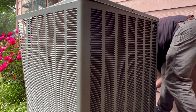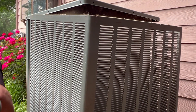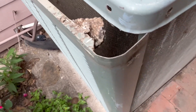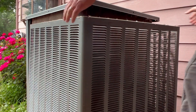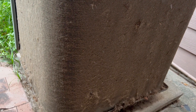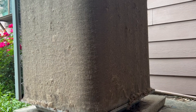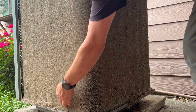However, what I'm going to do is remove the cover and show you how clean or dirty it is beneath this cover. This is an old wasp's nest, so you're going to want to be careful if this is something that you're going to be doing yourself. So we removed the cover, and these coils are not clean. The condenser looked clean when the cover was on, but once you remove that cover, you can see the mat of dirt and debris that is on these coils.